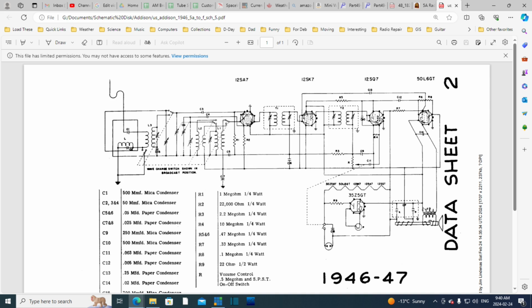If there isn't one of these here, this radio cannot operate. Quite commonly these are mounted right on the speaker. And so, did I look? I don't remember seeing it. There's nothing mounted on the speaker. The new speaker, or the old one for that matter, there doesn't appear to be an output transformer. Well, you know what? That stops the process right there. We got to figure this out. No output transformer, this radio cannot function.